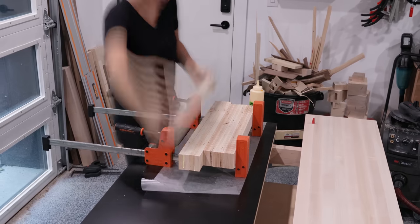Next I route the space for the cover plate, which will be the thickness from the top of the vise to the top of the workbench — same process as before with a hard stop for the back of the cut and the fence adjusted for the sides. I thought it would be a nice touch to make this cover plate out of some scrap walnut from the drawer fronts. I re-sawed a piece almost to the desired thickness at my new bandsaw, ripped it to width at the table saw, and it was a perfect fit. The corners needed to be knocked out, which is easy to do with a corner chisel. Now it's a perfect fit.